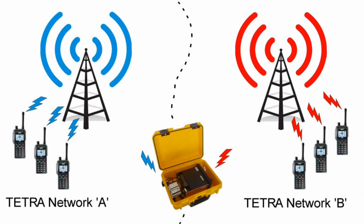So yeah, planning has to be meticulous. Avoid interference, maximize the signal. They even recommend keeping cable runs as short as possible. Less signal loss that way. Makes sense. What kind of things does a site survey look at? Oh, everything. The location itself, obviously. How much sun it gets if it's outdoors. Mounting height, power availability, including backup power, that's critical. Where the network connections are, the earth points.